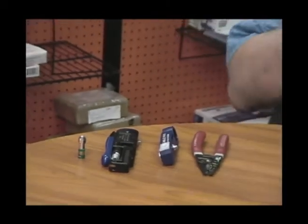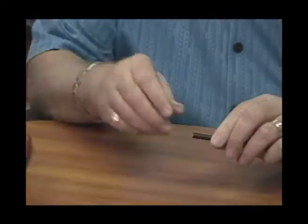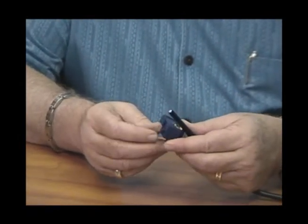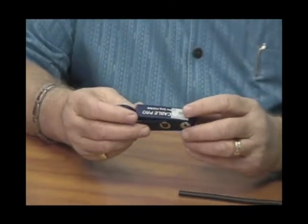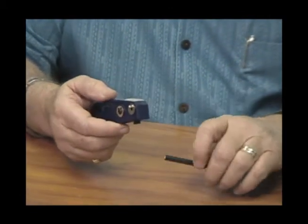Let's get started. The first thing we need to do is prepare the cable. This is a piece of RG6 60%, which means it has an 18 gauge center conductor and a 60% shield. Set the strip tool up to strip RG6. I also like to put a piece of Velcro on the top of the strip tool — that helps comb the braid down and simplify the installation process.